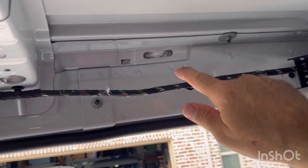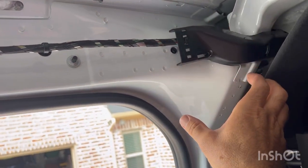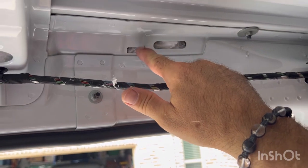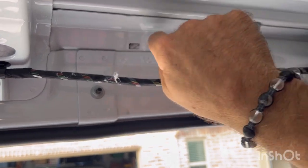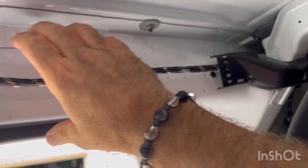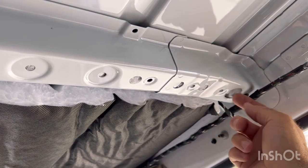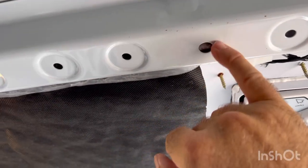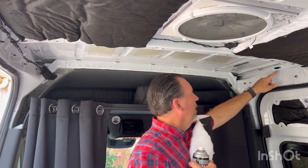This tiny little slot right here — you can see some of the insulation coming out. There's a whole section on the Sprinter van that goes down here that you can fill with insulation. The beauty of insulation is you can do a slice bigger than that hole, scrunch it down, and then use a screwdriver to push it all the way in and all the way down. I've probably got six pieces all the way down through there. I'm doing the same thing pushing insulation in on this side and using the screwdriver to pry it through — insulation all the way across.